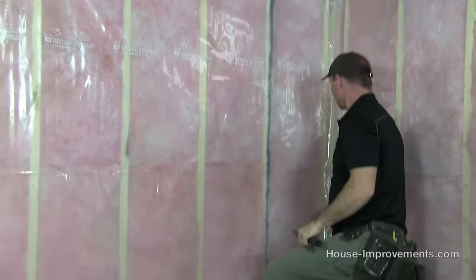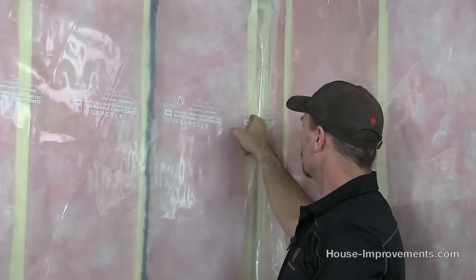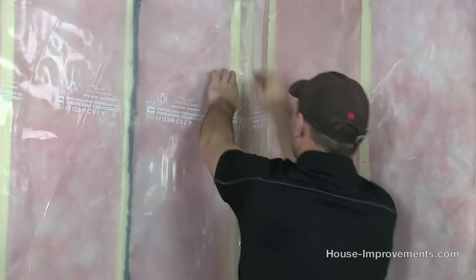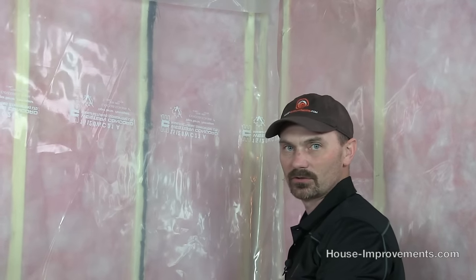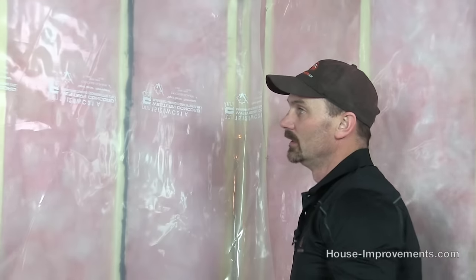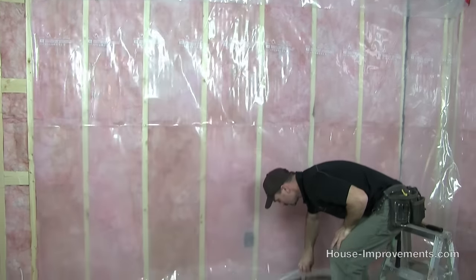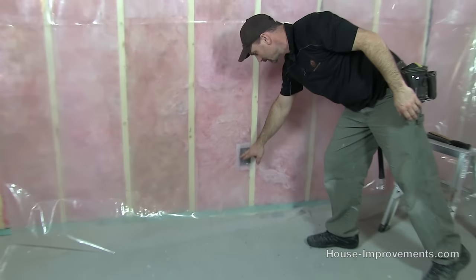When you get into corners, especially when you're going around a corner and continuing on, make sure you have a bit of a fold of the poly in there. If you pull it across too tight — say you've got staples here and staples over there but nothing going right back into the corner — when you go to drywall it, you're either going to cut that poly or have a hard time getting your drywall corner nice. Make sure you've got a little ripple back there so the finishing material can go right back in. You want to make sure the poly goes right down to the floor and have a little bit of excess as well.